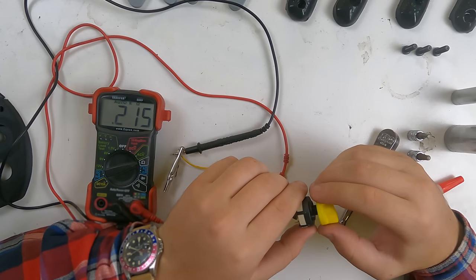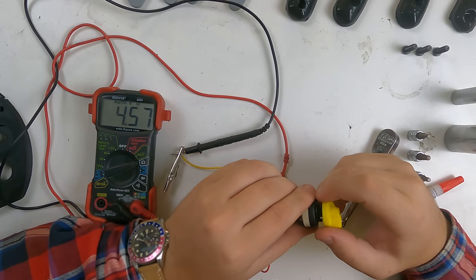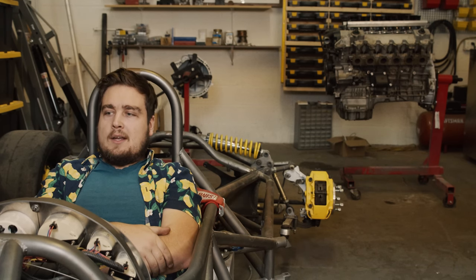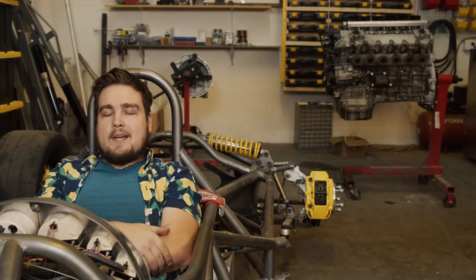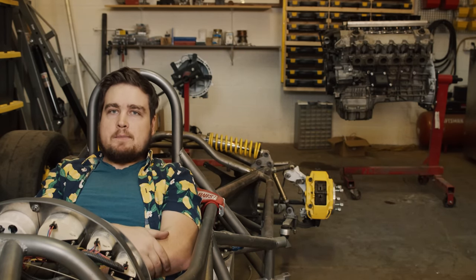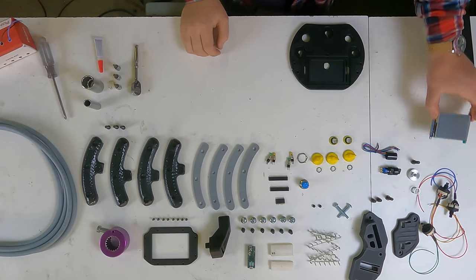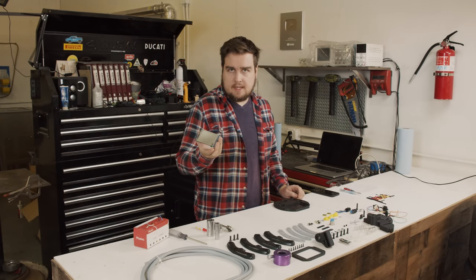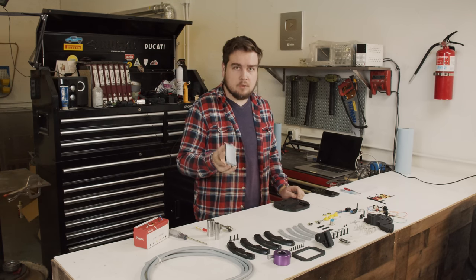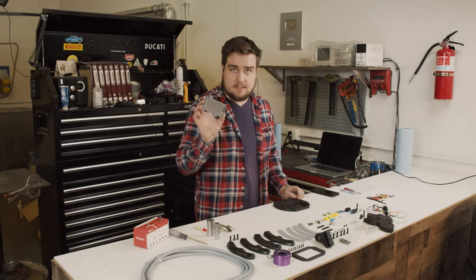Ideally we are in position one with a 220-ohm resistor and then we can go to the next one. One of the things that led me down this was when I was working on the Formula One active suspension, and I realized that zip-tying wires running back and forth to controllers on one end or the other of the car wasn't really practical. So if we can design something with expansion in mind and a good base for some of these other projects I want to tie into this — this TFT display is from Adafruit, their 320 by 480 TFT display.